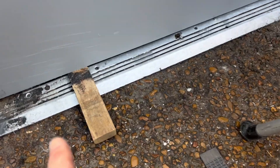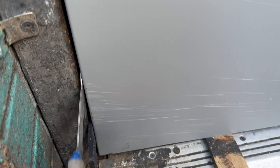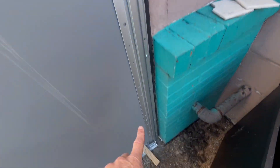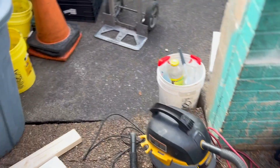Now you have to set the door in there. I use some wedges and shims because we want even gaps around the door so we can attach it to the continuous hinge. I use my five-in-one tool and a little pry bar to get all the gaps set just right. Then I put in four self-tapping screws into the door side of the continuous hinge. Four screws will hold it, but if you have to move it you still have plenty of extra holes. Take out the wedges — the door closes properly, no binding, no rubbing, no screeching. Now let's put in the rest of the screws.